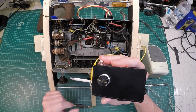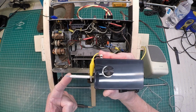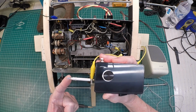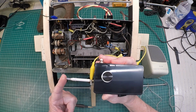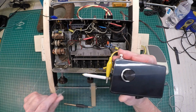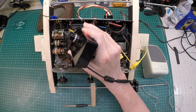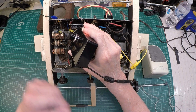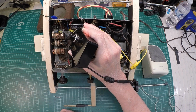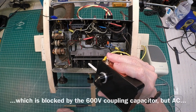Now, what's causing the hum? There's a couple problems. You can still see that I have my resistor in place. The plate is not that high impedance location, so we need to remove that. You see I've got these where I can just pop them off here. Let's reattach and see what we have. Still a lot of distortion. Again, you've got that DC voltage present.